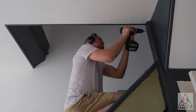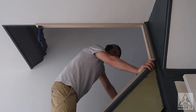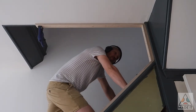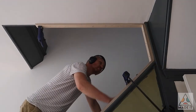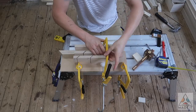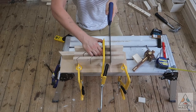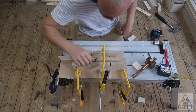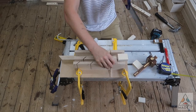After all the fitting, checking, and standing back scratching my head, I finally pre-drilled some holes and started to commit to building the thing. I started from the top, making sure each of the three pieces that had to be mounted to the existing structure fit tightly and were mounted properly. Looking back through the footage, I'm glad I took the time to make that mitre block — here I'm cutting a few spacers needed for the first few spindles, which had square ends at the top for which the standard pre-cut spacers wouldn't have worked.